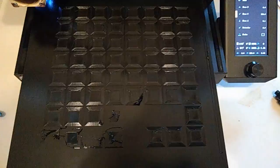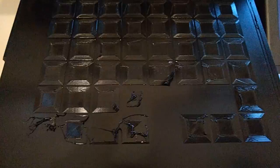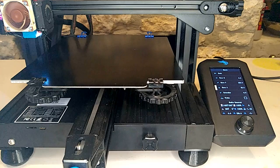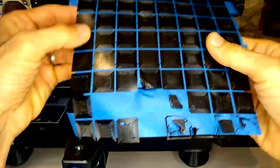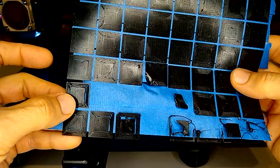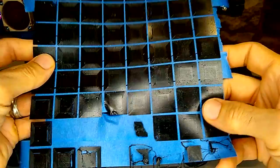Here's where we are after the test squares. Most of the problems are along the bottom and a few up at the very top, especially the last two rows in the center — some of those prints didn't even complete, a lot got hung up on the nozzle and dragged around. So let's go into the mesh and manually adjust. After you create your unified bed level mesh and print off your first set of test squares, if some squares look good but others either didn't print or the Z offset looks wrong, you'll need to manually tune those areas.